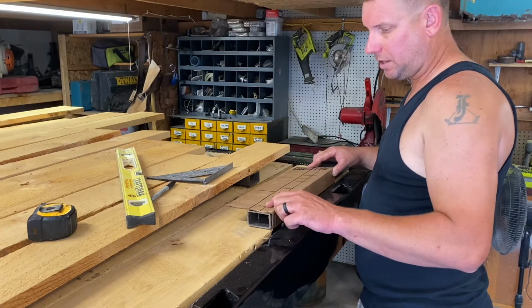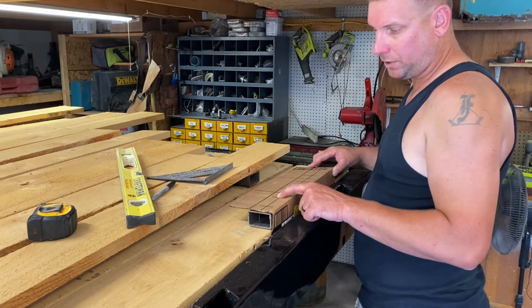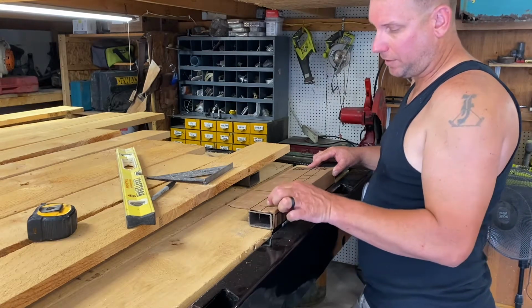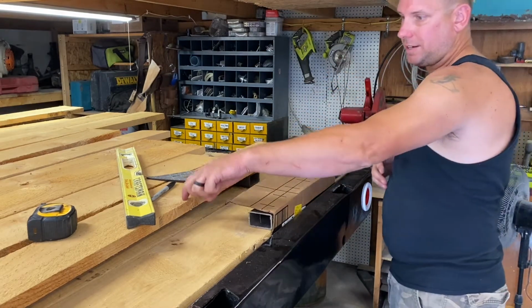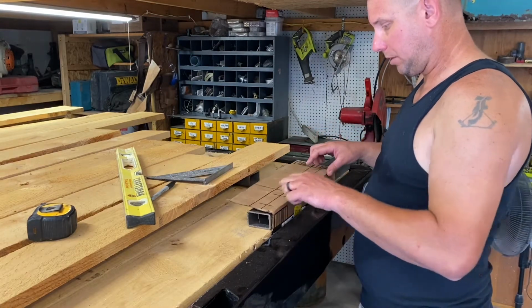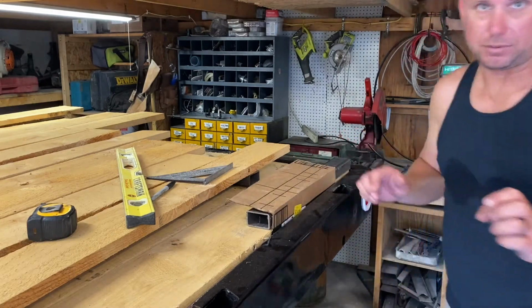But given that these vary a little bit, on a nominal 6 inches, I did 1.5 inches up from the bottom for each bolt hole, and then 1.5 inches down from the top. So we've actually got a 3-inch span per board. That gives me a little bit of fluctuation, so those carriage bolts can not be right down at the very bottom or top of a board. But anyway, got those all marked out. We can kind of lay this over the edge of each one and put them in the drill press. So let's go to some time lapse.